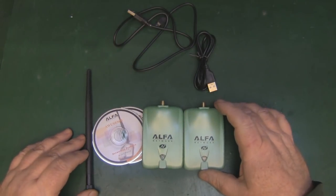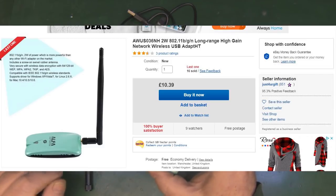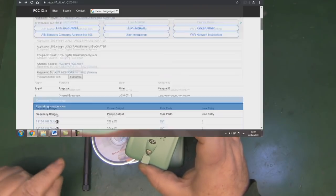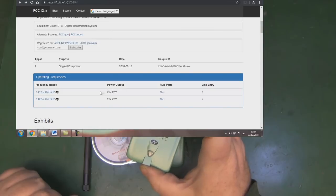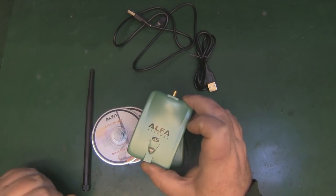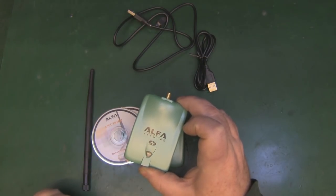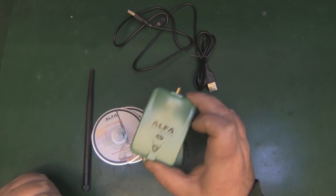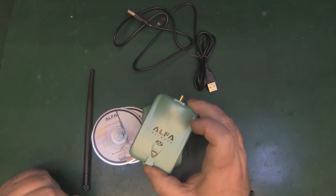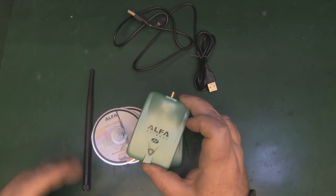I had a look around to see what fakes are out there at the moment, and it seems we're being flooded with fakes of these. A lot of sellers aren't trying to cover it up as much - they're openly selling these for around a tenner, and they're also claiming these are 2-watt adapters, which they won't be. Alpha wouldn't make a 2-watt adapter because they probably wouldn't get FCC regulation to sign off on that. With 2-watt, you need serious heat sinking inside the card, and it would probably also struggle to run 2-watt just off the 5-volt USB in a laptop - there's just not enough power. Walk away from one of those.